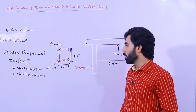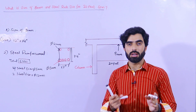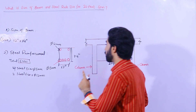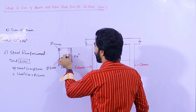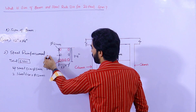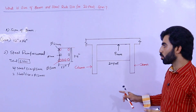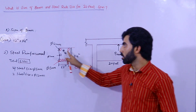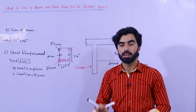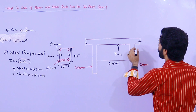One more thing: if you want to build a third floor — in the case of three stories — remember that we will use two more side rods whose diameter should also not be less than 12 mm. For two stories, you can use four steel rods at the bottom and two at the top — top diameter 12 mm, bottom diameter 16 mm.